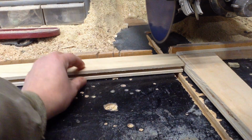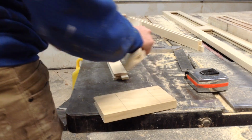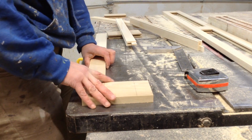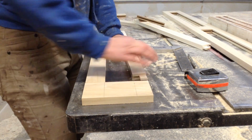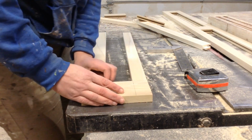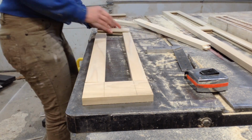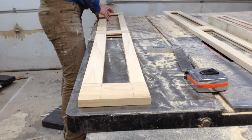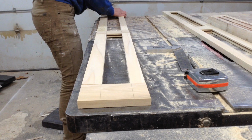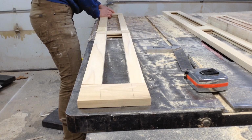And that is because if you watch any of these videos, you know I talk about how relative humidity affects anything that you build. As wood either gains or loses moisture, it will expand or contract. If you design something and build it the wrong way, it could actually start to fall apart at worst. At best, it'll still be affected by those seasonal changes, but you'll start getting gaps in all of your pieces.